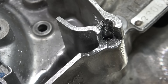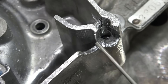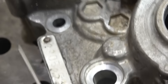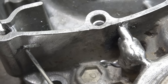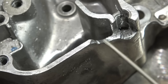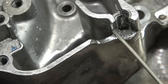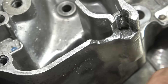I've cleaned it up and that bit there has fallen off altogether, so I'm going to build that up first. I'm going to chop all this off eventually. But if we look around the side, there's a crack there. I've drilled the crack all the way out and I'll weld that crack up as well. The first thing is to try and build that back up to the same height, join it in, and then all this gets chopped off.